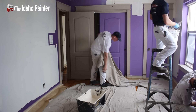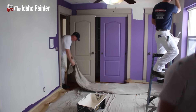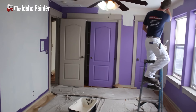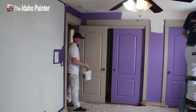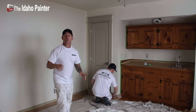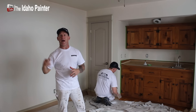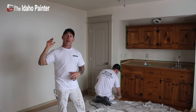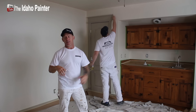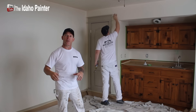I'm just working right along in this room. Greg has finished putting the paper and is laying down some drop cloths. John is cutting in, and Zach is running the 1-inch tape. I've already started rolling the first coat on the walls and the ceilings. We're back in the first room now — it's all dry, it's been approximately one hour. We got the other room all first-coated and all the cut-ins done. Because this room wasn't drying fast enough, we actually turned on a fan to help it dry, but we went and did a third room and got that one all first-coated too.